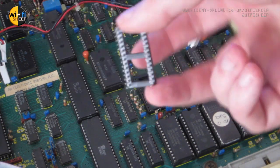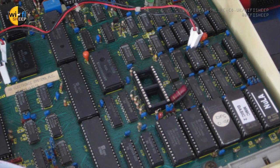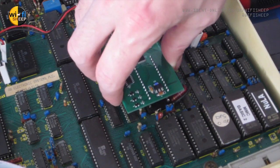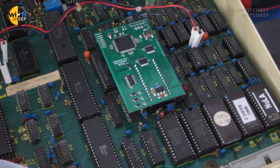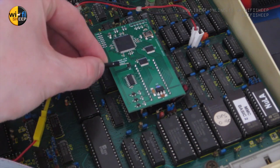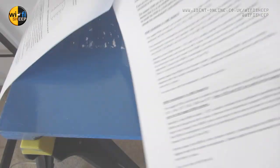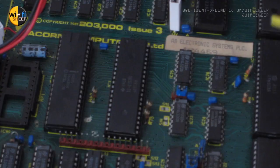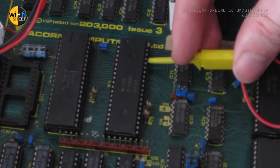I'm a little concerned about this resistor that's stopping us from putting the board in, so I've got the chip holder which came with the kit. I'm going to install this chip holder on top to give us a little bit of height, and now I'm going to try fitting the board. Then I've got the extender cable piece to fit on. We need to refer to the manual — on the Model B it's IC3, pin number 37, which is the fourth down on the right-hand side — just connect like so.